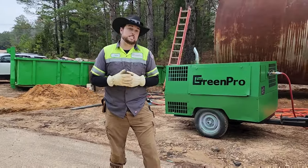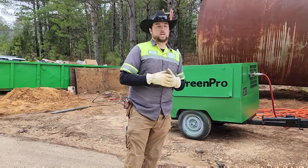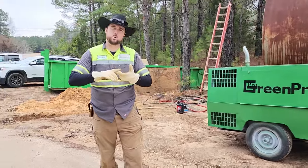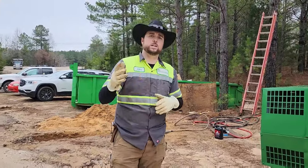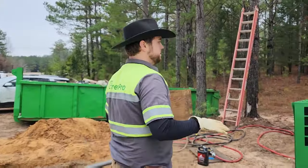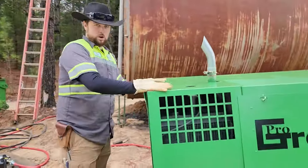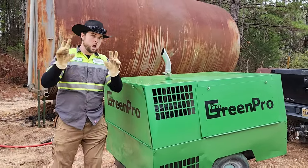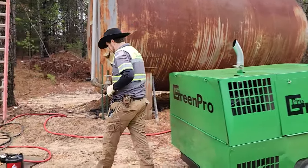We've done a video on HDD boring, which is directional boring, and now we have another type of boring machine known as missile bore, mole bore, stinger bore, there are very many names for it, and I'll show you why. So this is a giant trailer-mounted air compressor putting out a ton of high pressure air, and that's what this mole, we're going to call it, runs on.